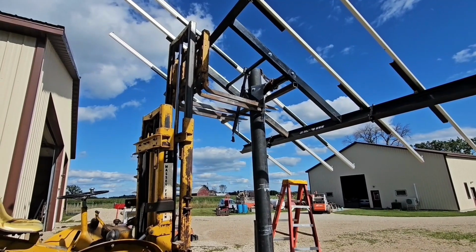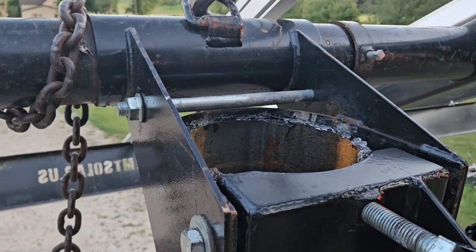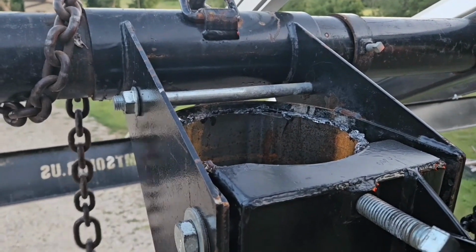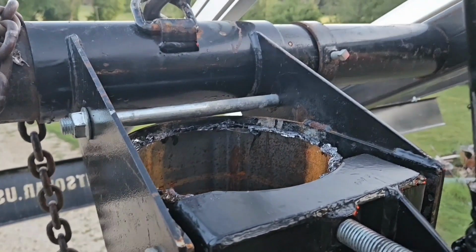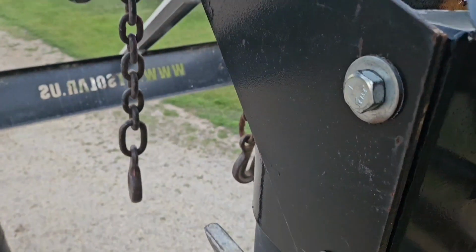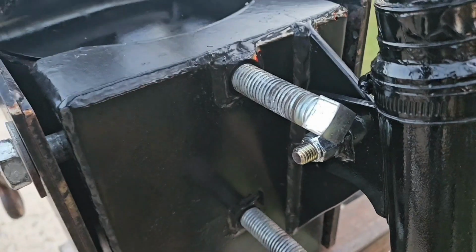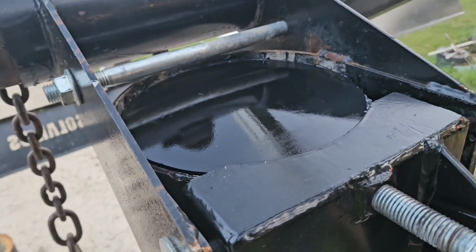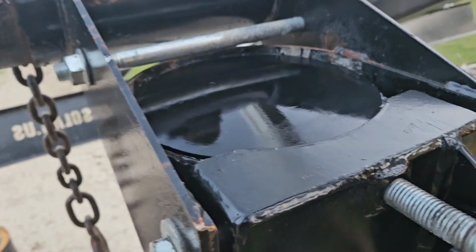So anyway, later. So it's a few hours later here. Yeah, a neighbor stopped by, and it was getting hot out here before, so I was gone for a couple hours. But this is the second pole. I got to raise all the way to the top. So put some caulk there. And then I'll put my plate in here. Hang on a moment. There's my plate. And then I got to tighten these set screws here a little bit to bring that back and lower it down. But anyway, this part will be done, and tomorrow I'll be hanging panels.